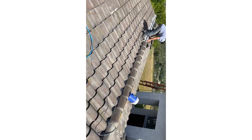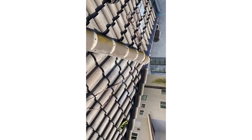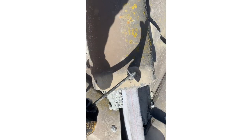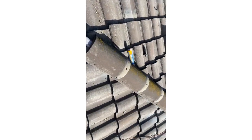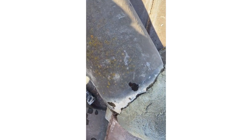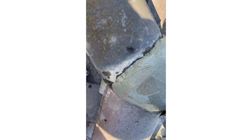When you do the hips — those are the tiles that go down at an angle, called hip — you don't have to apply roof cement or caulk because they go in at an angle, and each tile weighs about 10 pounds. They sit in the hip cup and the wind has never blown them off, so I only use glue or roof cement on the ridge. At the junction between the ridge and the hips, finish it with a mortar cap.